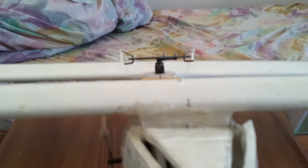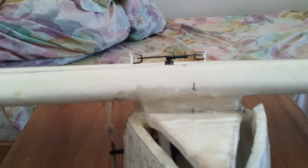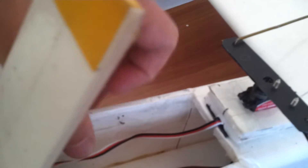In my case, I had a little bit of twist in the fuselage, so the canard was a little bit twisted relative to the rear wing — they were not in the same plane. After the crash, those sections had been opened and torn a bit, but I was able to glue them together so that the canard was no longer in the wrong plane relative to the rear wing.